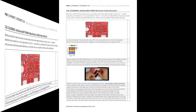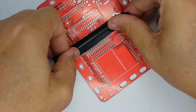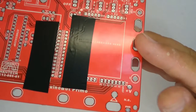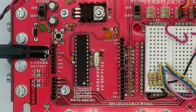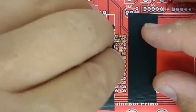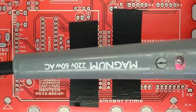The resistors are the lowest profile parts. In datasheet 3.03 you'll see there's a resistor color code chart. One of the first things we do is use some electrical insulation tape to mask off the printed circuit board before placing the resistors — this means only the two inner rows of holes are visible, which will prevent the resistors from being placed incorrectly. The printed circuit board can be destroyed by removing wrongly placed parts. First, find the 220 ohm resistors and place 14 of them on the printed circuit board over the silk screen markings. Placing a small box under the printed circuit board gives somewhere for the resistor leads to go when you push them through.